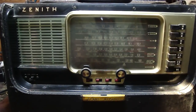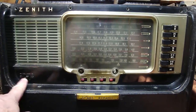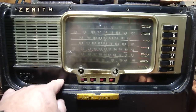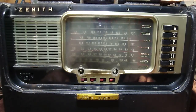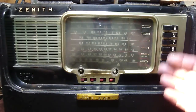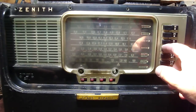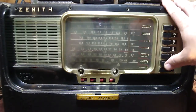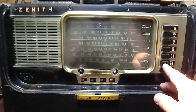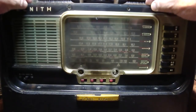So let me get started on that. Okay, all the screws are off. The knobs are off. The 2 screws holding the dial light switch are now off. I don't have to worry about the headphone jack because there is none on this. Okay, and I'm going to pull this out through the front. Now, just like the H500 radio we did, hopefully these buttons are just sandwiched in between the band switch on the chassis and the bezel itself. So these should pretty much stay in here when I go to take this off, unless I take it and hold it upside down. So here goes.